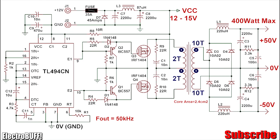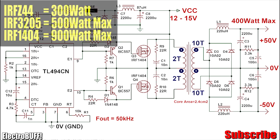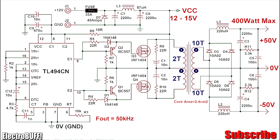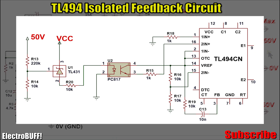The maximum wattage for this circuit is about 500 watts, but you can draw more with some modifications. The circuit is designed to be powered from 12 to 15 volts, although 10 to 15 volts will work, but because in this circuit there is no feedback the output will vary. However, I'll show you a simple feedback circuit you can use to provide a regulated output voltage regardless of the input.